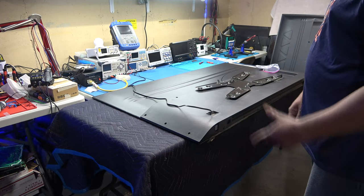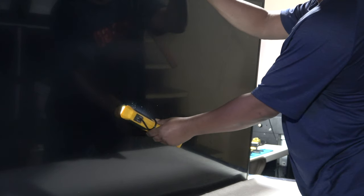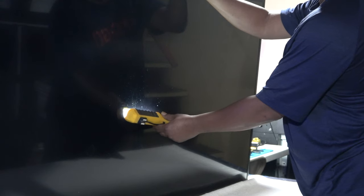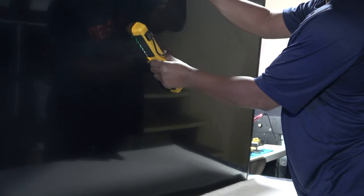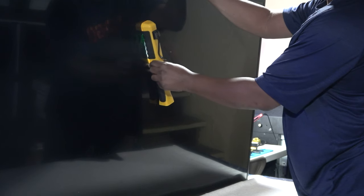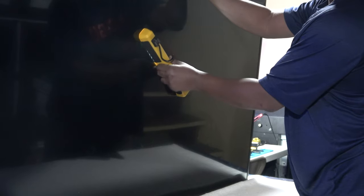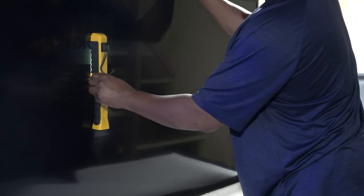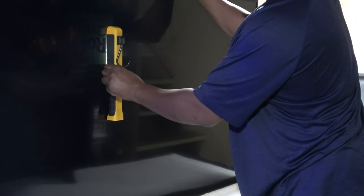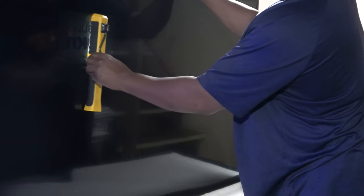Today I've got this 65-inch TV. Watch - you look on the screen, I can see something there. I can actually see where it says Hulu right there. So looks like we obviously have a backlight problem.